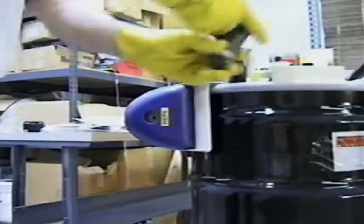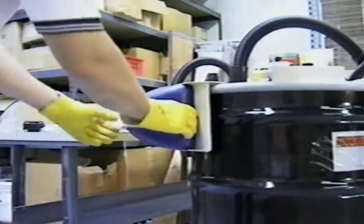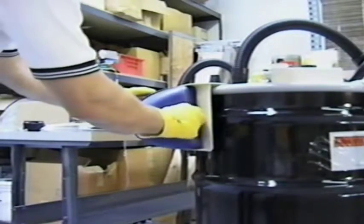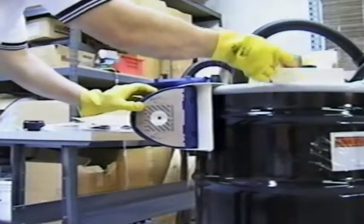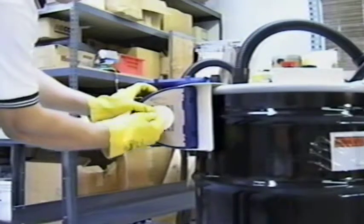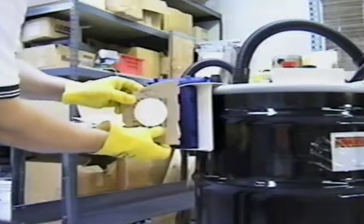Press the yellow label marked PUSH on the farmost right edge of the curved blue filter case to open the filter case door. Carefully remove the door and immediately place a circular white label from the bulb eater filter kit over the center hole on the cardboard front of the filter. This prevents powder from escaping during the change-out process.